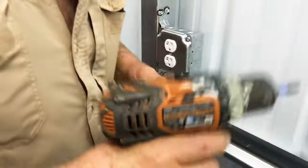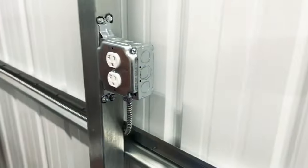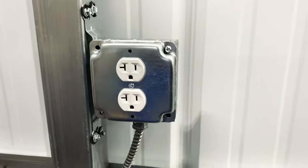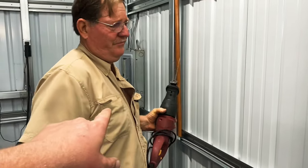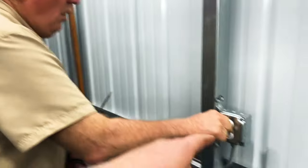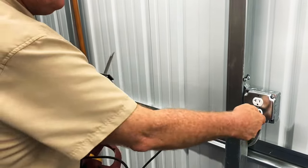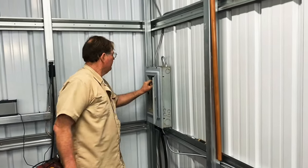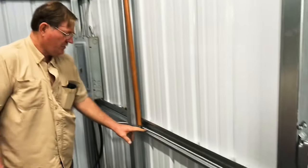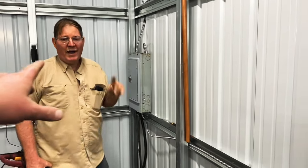That's got to set, so don't strip it out. Now we're all ready — good to go. Let's plug something in and show you that it's working. Easy enough — anybody can do this. He just turned the breaker on. You always want to be working with that wire off — somebody's gonna be like, 'Oh, we'll just wire it up' — no. Check both sides, make sure your receptacle is not broke. We're done now. That wire goes over there — you gotta strap it every 18 inches. We'll show you how to strap it later.